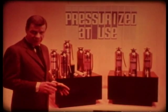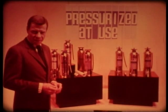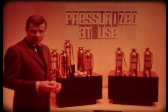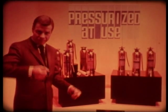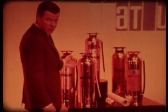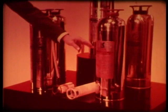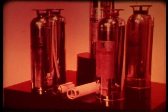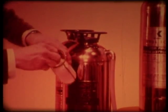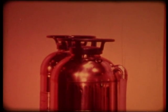Most other portable extinguishers give you an assist in the form of internal pressure which drives the contents out for you. In this group, the unit is stored without extra pressure inside. But when you need it, gas pressure is formed on demand in one of two ways: either by mixing two gas-forming solutions, or by releasing gas in a pre-pressurized cartridge. The obvious way to mix two solutions is to dump one into another — and that's what happens with the inverted type extinguisher. Each has an inner container of solution with a fall-away stopper that drops out when the unit is inverted, releasing the solution. That hand-ring around the top gives you the best clue to the inverted type.